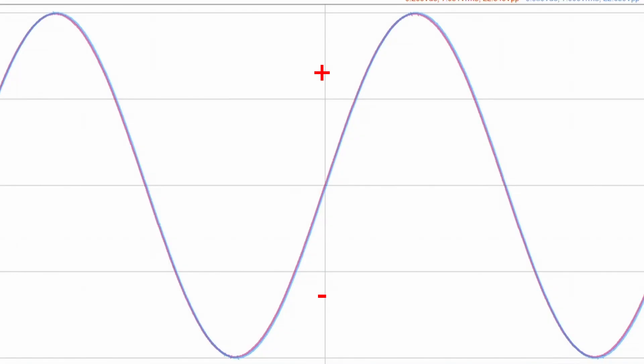You might ask, won't this need a lot of power supplies? Yes, and this is what makes or breaks the sound. Think about it — if we take an op-amp or any output stage, you're supplying it with power. That sine wave, which is the sound, is created by a plus and minus voltage. Op-amps often require plus 15V and minus 15V, or plus 5V and minus 5V — you need that plus and minus to create the up and down that creates the sound. That sine wave is coming from the power supply, so you are actually listening to the power supply.